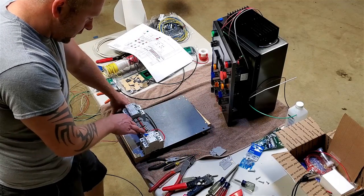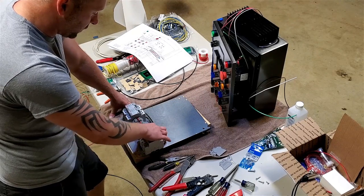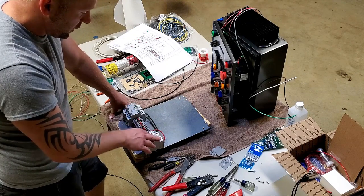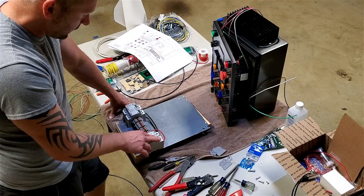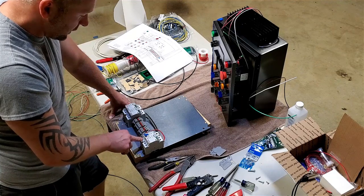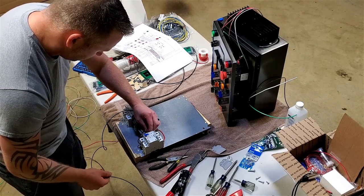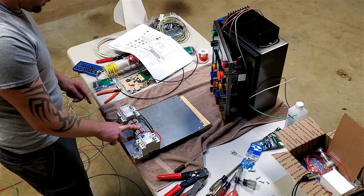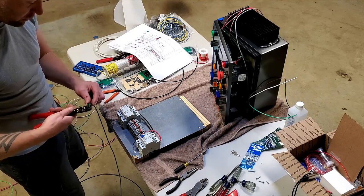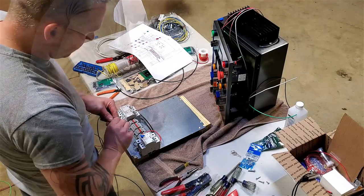I am on 12 gauge now. If I send the power into this, this basically energizes these blocks on top. This is my 6 amp circuit breaker that basically feeds the rest of the entire panel. So let's come out and feed this with some 12 gauge. And chassis and everything, that's got to be 10 gauge. That's what we got coming in.